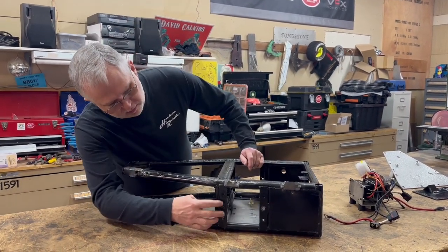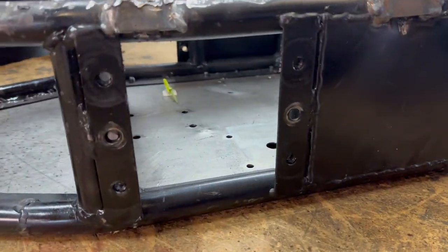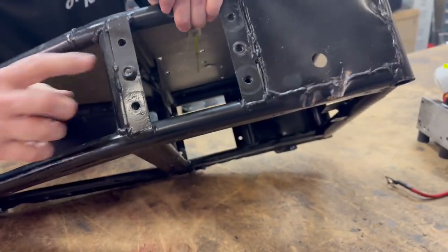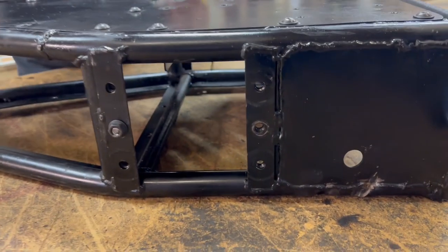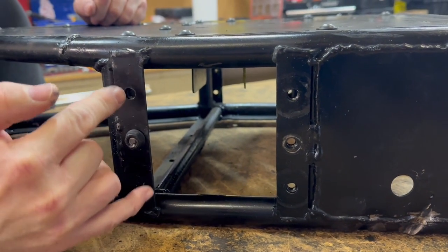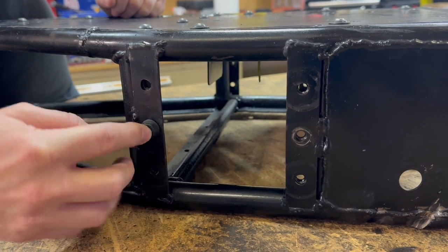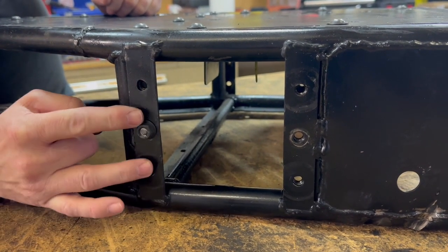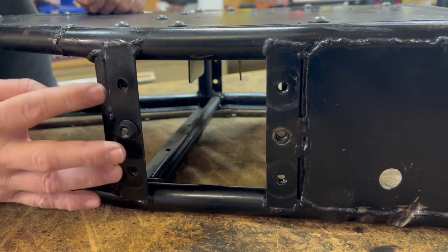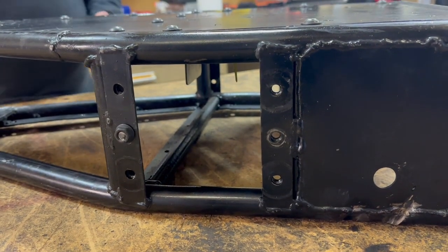Where the drive motors mount, we snapped off a few of the bolt arrangements I had there, so there are some changes I may need to make. I still have two shock mounts here, and right now I've got a single pinning bolt — I may double that and put two pinning bolts there to have a little extra support. That would be a fairly big increase in strength for not a lot of weight, so it's probably worthwhile.